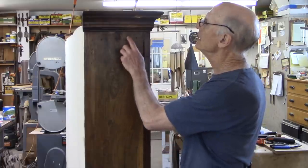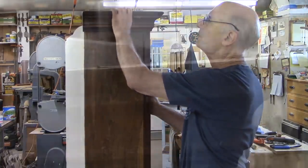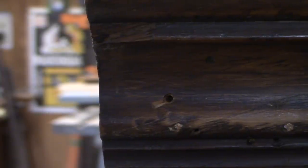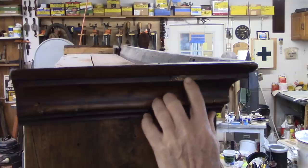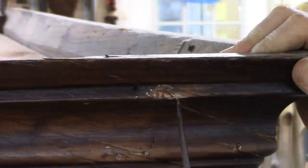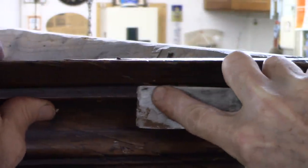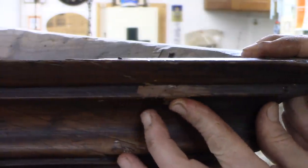Now to the other side. This molding has also been broken in the past, but it's really strong. But it definitely needs some touch-ups — I don't know what happened there, and there's a hole. I'm going to use epoxy putty on this, but because it's on a corner like this, on an outside edge, first I'm going to poke some holes in it to help anchor the putty. Then a little bit of water on the knife, a little water on my finger. And then after about five or six minutes, I take a gray pad and gently remove a lot of the excess.